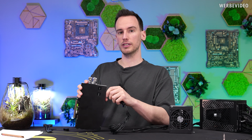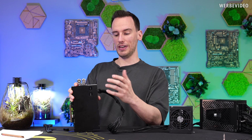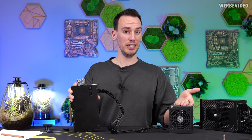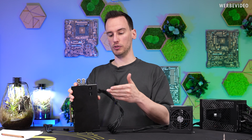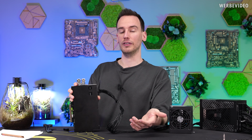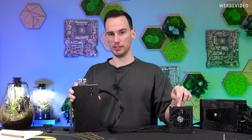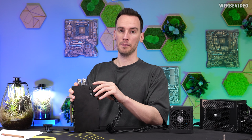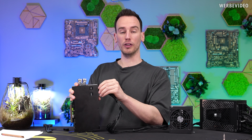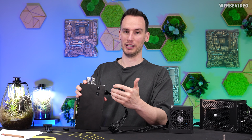Oh, okay. There are a lot of theories how this might happen, and one is, for example, also the contact resistance inside the connector. But if it would just be the contact resistance in the connector or the GPU side, then it would be very unlikely that you would have also the same failure on the PSU side. So it can only be a very uneven current distribution within the wires, which can only be caused by, for example, two wires having a very low resistance and also very low contact resistance, and then, for example, four wires having a very high contact resistance. It's basically the only way how this would work. Otherwise, we would only see the failure on one of the sides, like either on the PSU side or on the GPU side, if it would solely be a problem of the contact resistance of the pins, but that's not the case. I think I will just try with brutal force and see if we can at least unplug it from here.